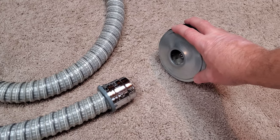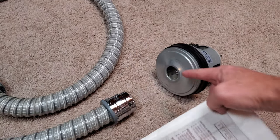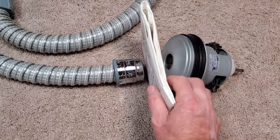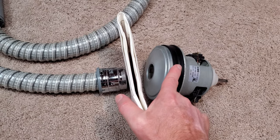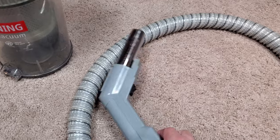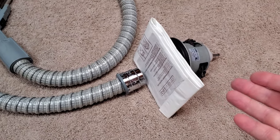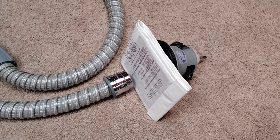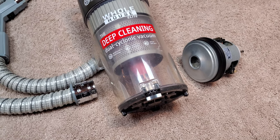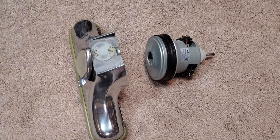Something's going to generate your cleaning power — your airflow. If it's a canister, you'd have what's known as bag first: the bag is placed right in front of the motor, and then your hose would be in this order. You have your cleaning power generated here, a bag to separate the dirt from the air, and then your hose, which people can clean with, hook up to a power nozzle, or whatever accoutrements they like. That's basically a bag-in-front-of-the-motor design. And here is a cyclone or bagless system — same principle but now bagless. Many of the original vacuums were bag last, also called fan first or dirty fan designs: you have your nozzle or hose, then the motor, then a bag that literally filters the exhaust.